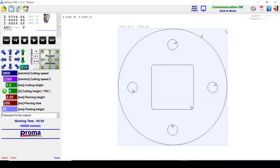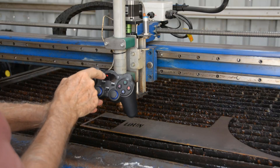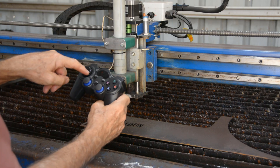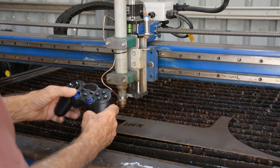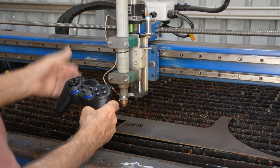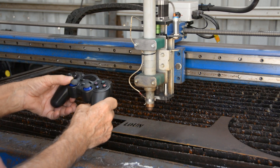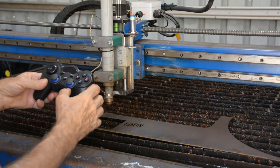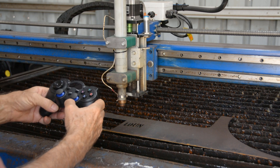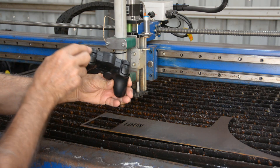We can go back to the table and simulate these movements using the controller. There's a little switch under the bottom — I turn that on, the little red light comes on, which means it's powered and ready to go. The left-hand toggle, if I push it forward or back, moves the gantry forward or back. Pushing it to the right moves the torch on the X-axis to the right, and to the left goes left. The right-hand toggle allows me to move the torch up and down.